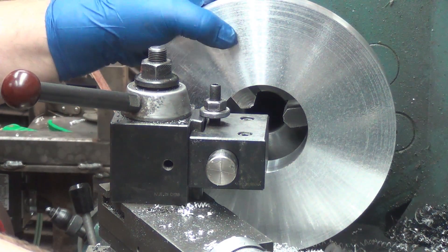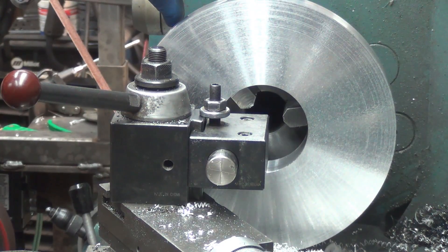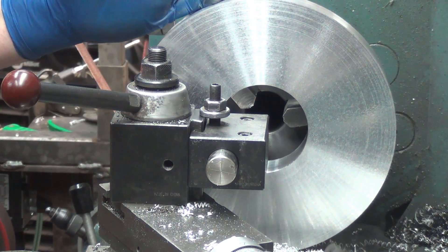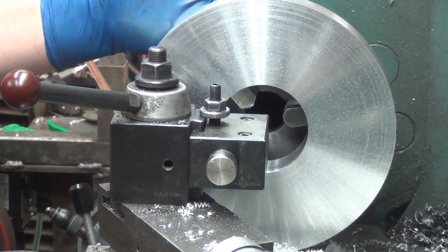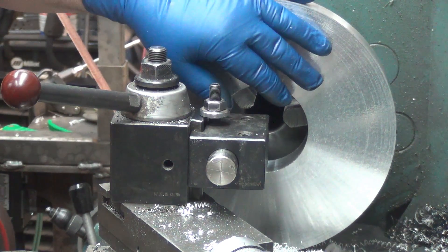Understand that this thing is still over an inch thick. I'm going to flip it over and grab it, but the jaws only reach maybe a half inch, and the flange that I need on the front is only about a half inch. So there's some no-man's-land in the middle there. I'll be able to cut the perfect hole in the backside, and then in another op I'll come back and address the backside and take the meat out.